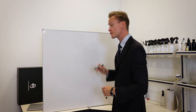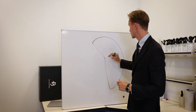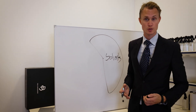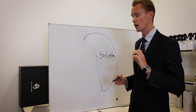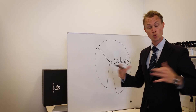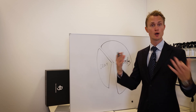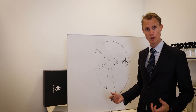So what does a polish consist of? First off, you have the main base, which is the solvents — and you could find a typical white spirit — but for us, that means turpentine, quality gum turpentine. And to that, we need to add the key part of our polish, which is the wax. For this we have beeswax, we have carnauba wax, but we also have mineral waxes such as montan wax.